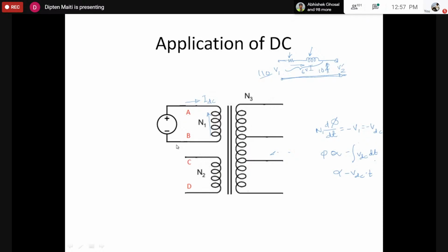Now, whether the flux should actually vary or not, of course it would vary, because if the induced EMF required to oppose the voltage is low, the current would increase. That would produce flux such that, at a certain point, the flux can oppose the applied voltage. So where is the problem? Do I have a problem in this logic, or is the problem anywhere else? You can come up once again. You can find any problem with my logic, or you have any other answer or anything you want to add. Anyone?